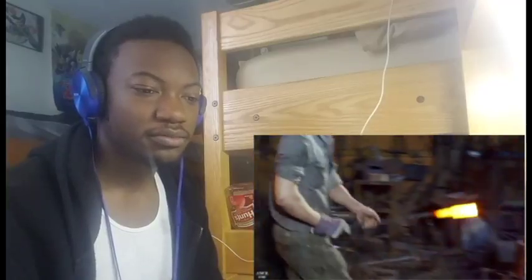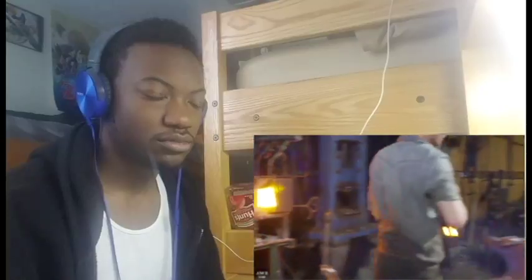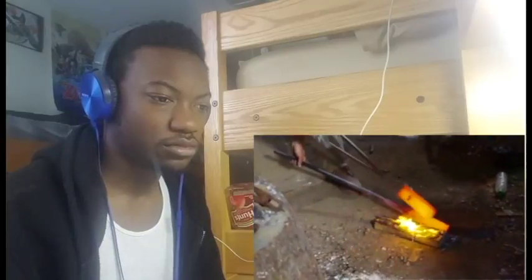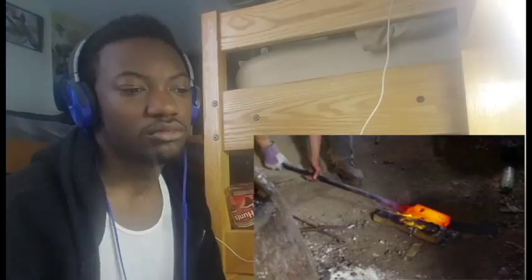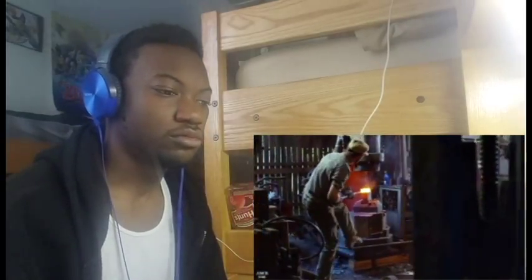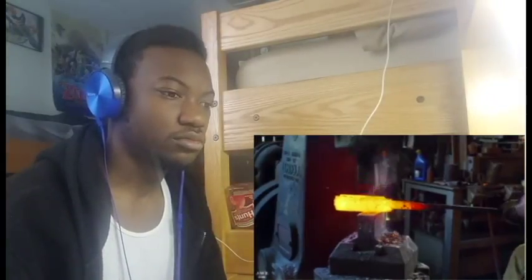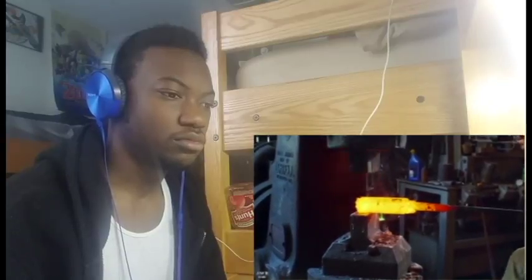Now that the iron is sized correctly, Ilya can attach it to the Damascus billet. It may look weird that Ilya laid his piece of metal onto a 2x4, but the reason he did this was to prevent any oxygen getting to the surface of that metal, making it scale up and inhibiting his weld. He now lays the wrought iron on top of the Damascus paddle, goes to the hammer, and very gently forge welds it. You can see that you don't need brute strength for this process, it just has to be the perfect strike.